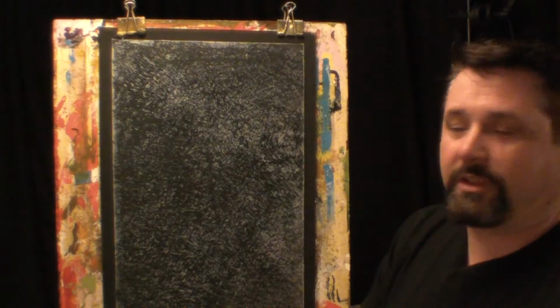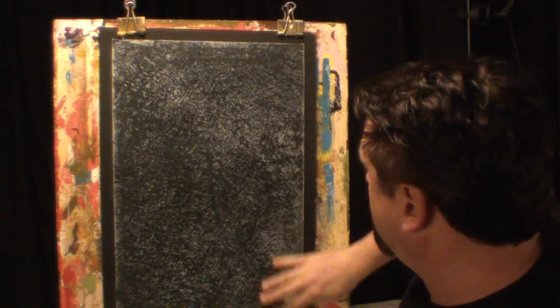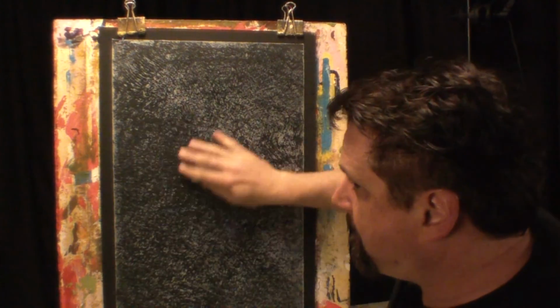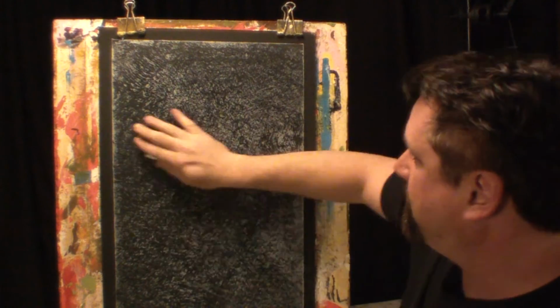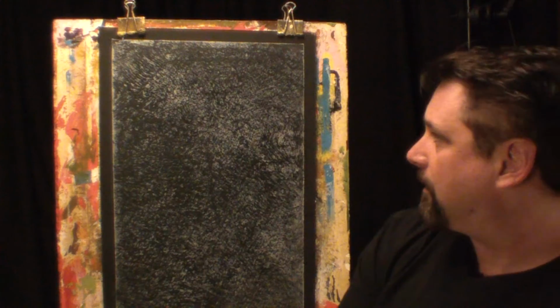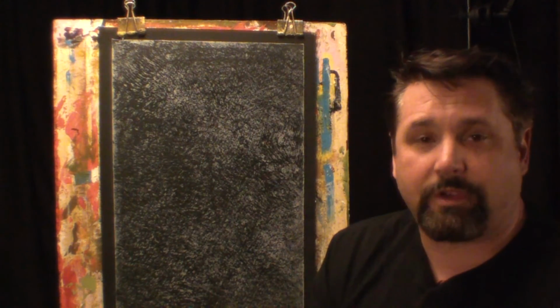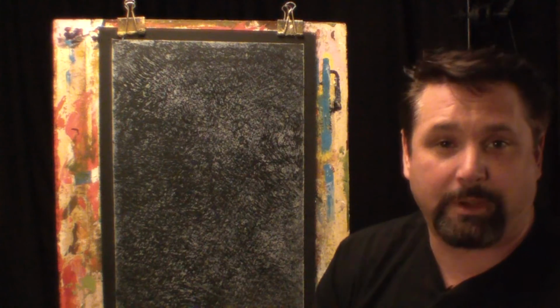Okay, so the plaster is set up. I'm going to simply take a clean, soft rag, go through real lightly and buff it out. If it was a big wall, I'd probably use my lamb's wool pad on my car buffer, polish it out. Well, there you have it. That's the terra finish we call liscio with the Toscano plaster. Perfect for any room in the house you can think of. Great for accent walls and any color combination is possible.